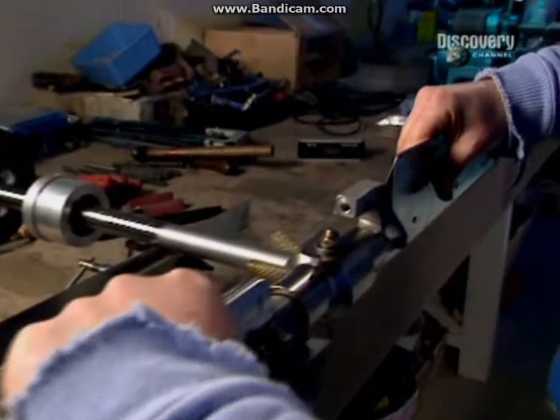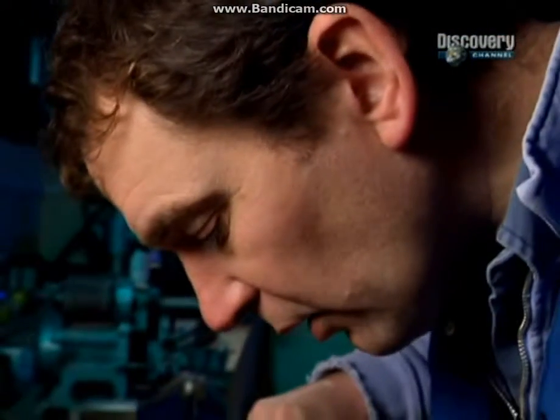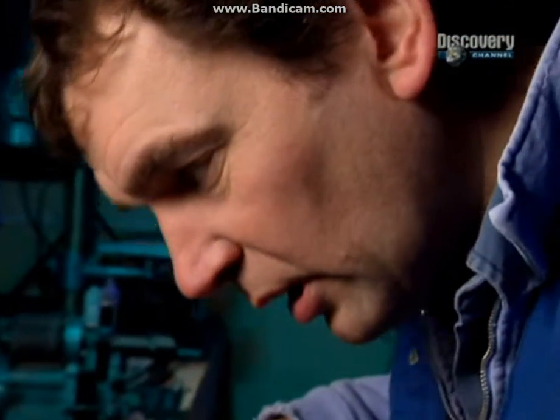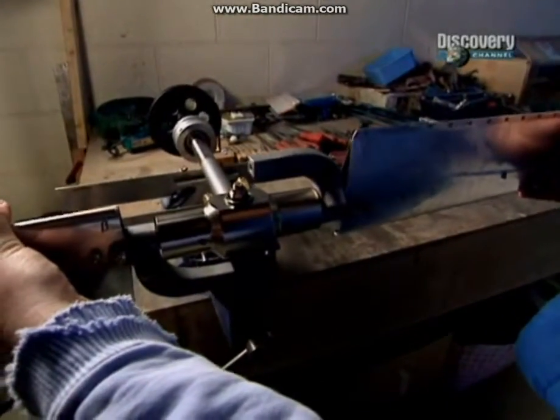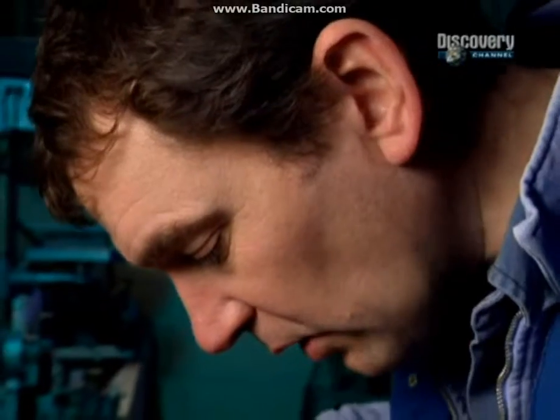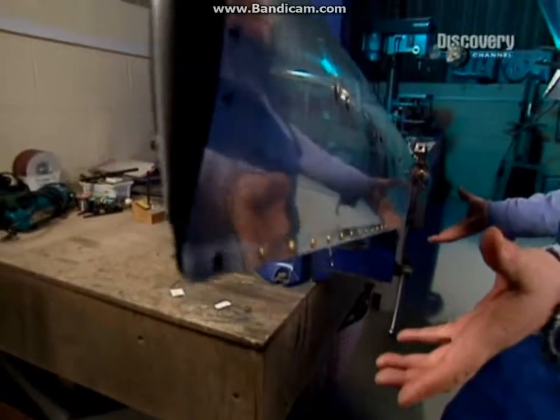Make sure that both blades are right up against their bearing stops and that the whole thing is free to rotate. And the point of balancing these blades is to stop vibration, because these blades, the tail rotor, will spin at something like 2,500 revs, which is 5 times the main rotors. So that's on there, and then just let go and see what happens.